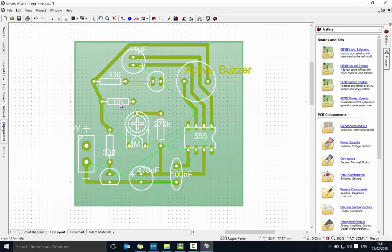When you move things, sometimes it works nicely, other times it goes horribly wrong — go easy when moving things, and if you make a mistake use Ctrl+Z. Move that to there. I'm going to run there into there — that's a nice easy one. I'll run this green line underneath there and around. Starting at this end, go to here, up to there, and around that corner. That connects nicely over there via that one. The positive needs to link together underneath — I'll use the space underneath this resistor and run across to this pin. Running from pin number four, going under there, and connecting.